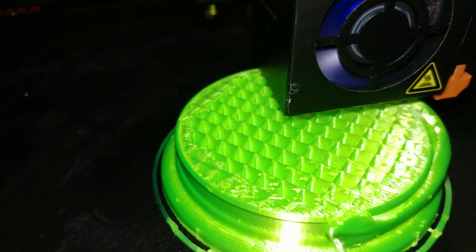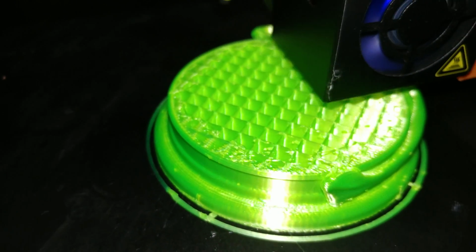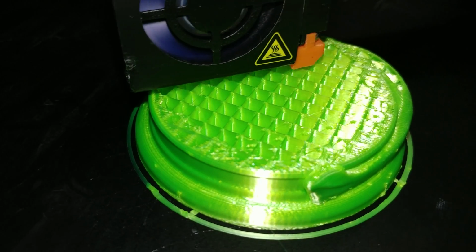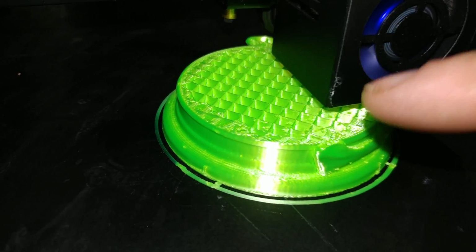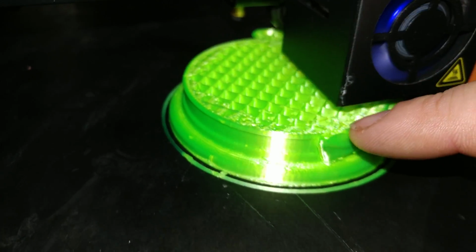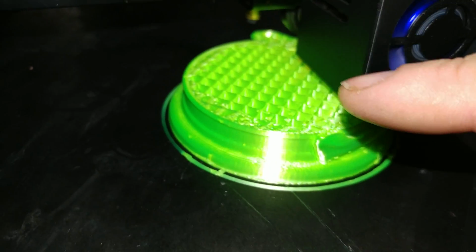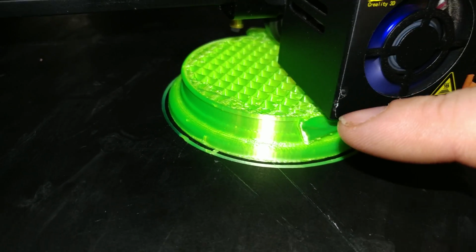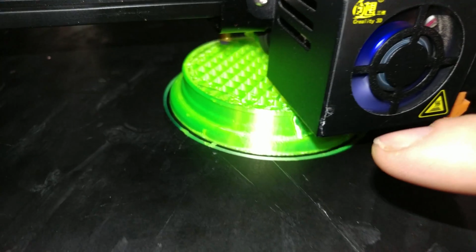The slicing for Simplify 3D is broken. Now, this is not just Simplify 3D. Apparently, this is all slicers, including Cura. I've seen someone do a Cura model that does the same thing, where it will begin to draw a solid top layer, but it won't draw it over the whole surface. Instead, it tries to draw a solid top layer just where it'll actually be exposed on the model, and then the rest in infill, but that can't work. That can never work, because you're dropping filament into an open space.